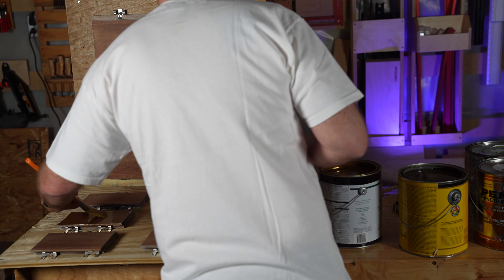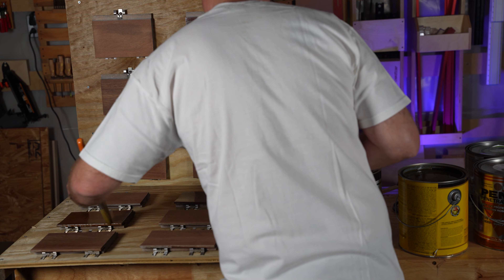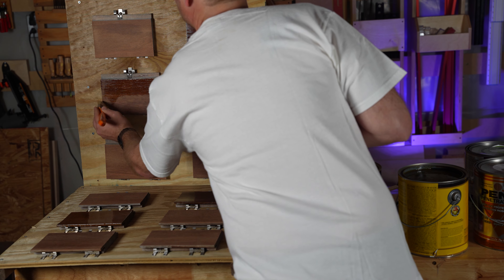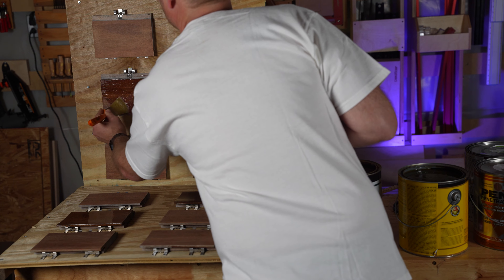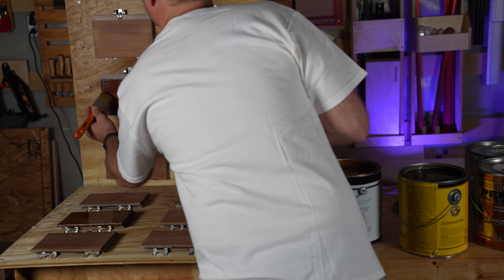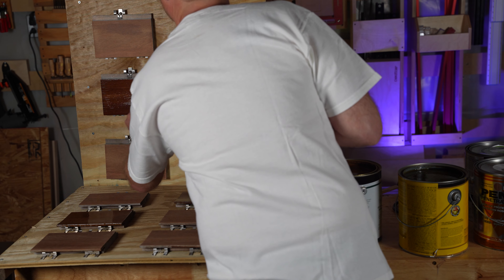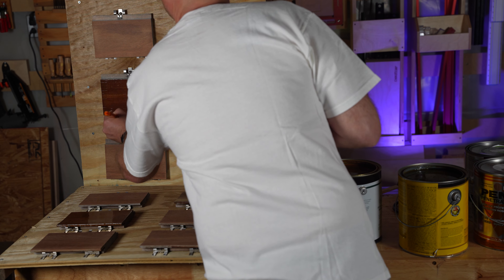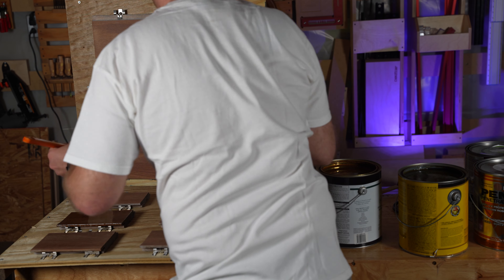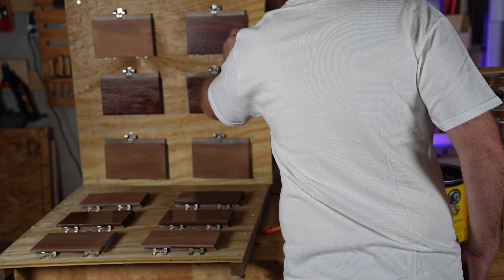I've brought the life back to all these pieces. I actually went ahead and decided to upgrade the test rig here with some new plywood, but all the pieces are right back in their original locations. One thing I forgot to mention is that the Cabot's had a different application than all of the other oils — it recommended a foam pad for its application, so that's what I did. It's possible that that's a contributing factor to why the Cabot's seem to outlast the other oils, but I'm a little skeptical of that. So this go around, I'm actually going to use brushes — the same type of brush for every single oil. Every oil gets its own dedicated brush.